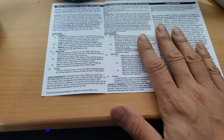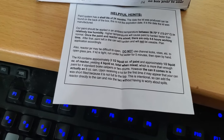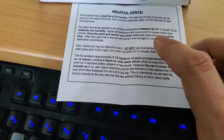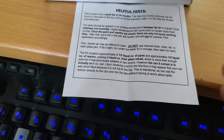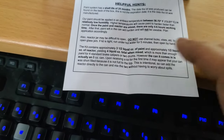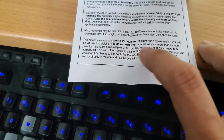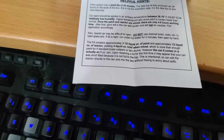I'm not going to read out the instructions — I'll put a link to the online ones in the video description below. Key notes: apply at 70 degrees with low humidity. Once you mix the paint and the reactor, you have four to six hours of working time, although many people say they really only had three. If the reactor jar is hard to open, don't use tools since it's glass — use hot water to loosen it. There are three and a half ounces of paint and half an ounce of reactor, giving four ounces total, which is half of the eight-ounce can — the extra space is intentional to prevent spillage.